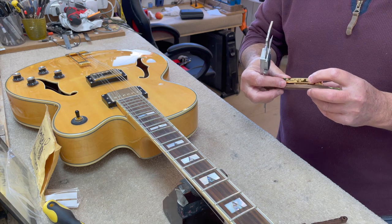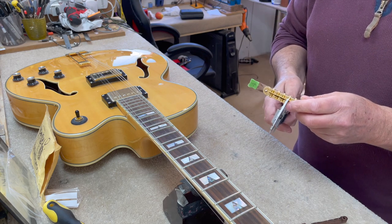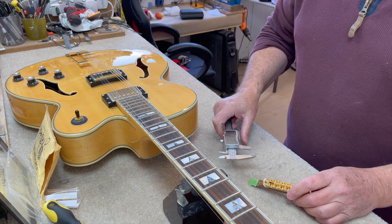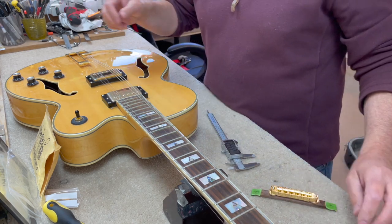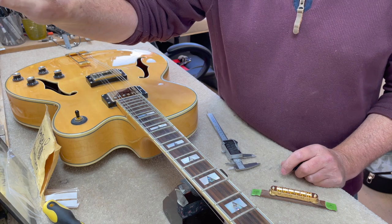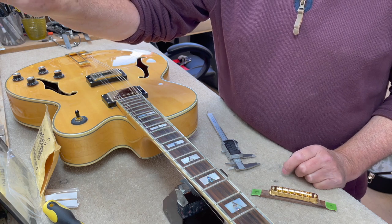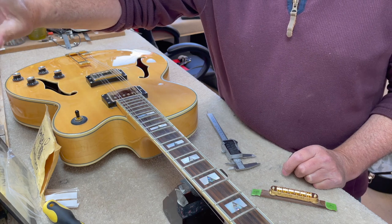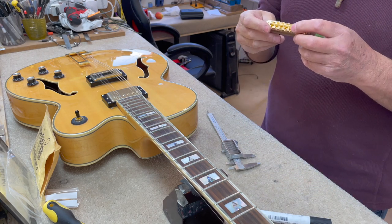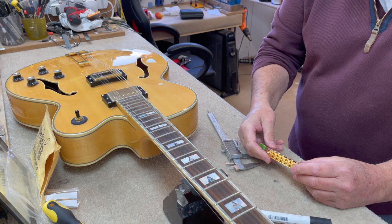This is interesting. This thing has practically no slots at all in the top of the saddles. They have impressions, but they don't actually go into the apex at all, so I really don't know what the point is. On this one we've got a higher height versus the next one of 22.22. So evidently there's a difference already of 2.26, but that's without the ability to go any lower. If we put that on, we can't go any lower, so it sort of defeats the object. Now, the question is, what do we do to reduce this down?